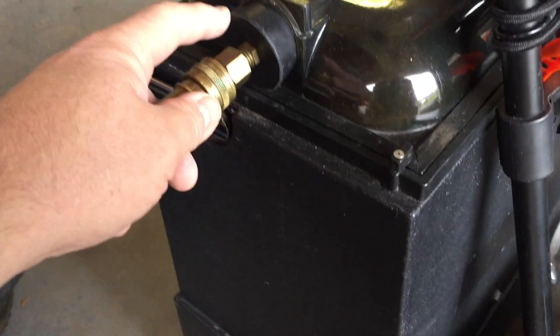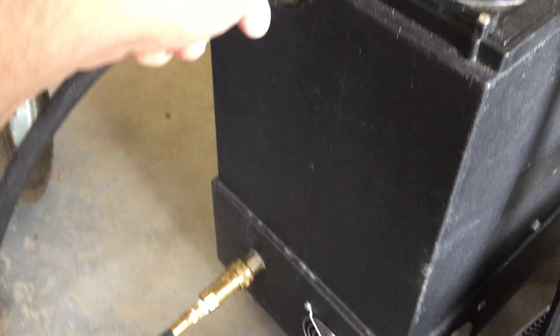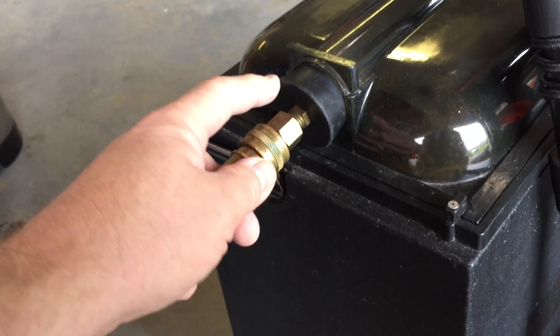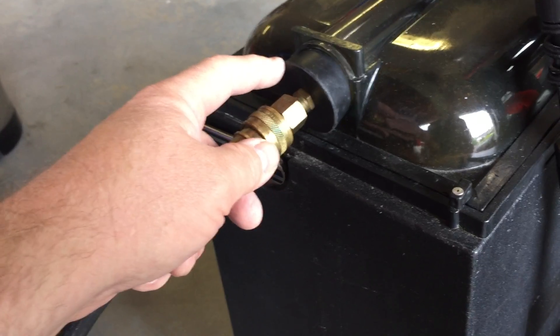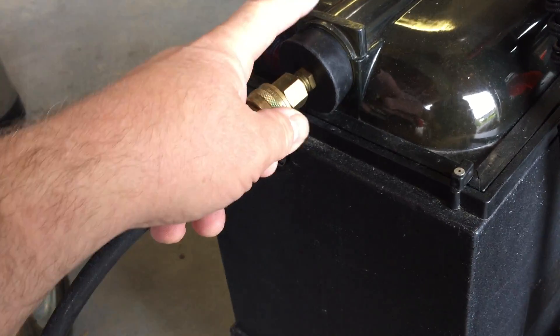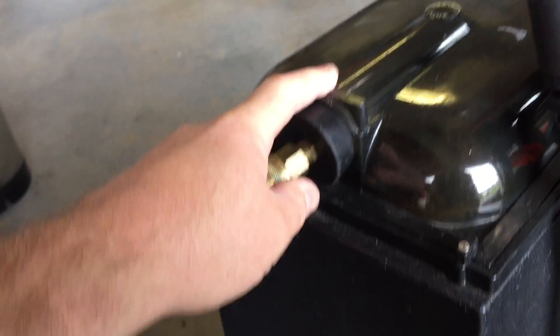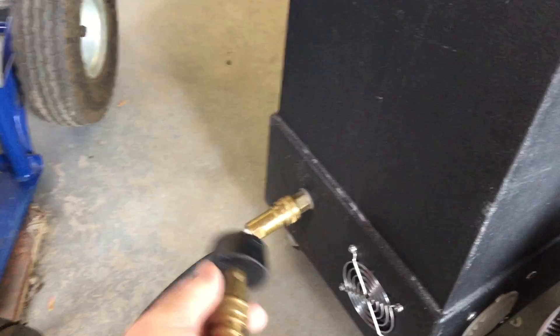In this case, for this machine it needs to be able to do that because this machine can use solvent for cleaning. So you have to remove every bit of solvent or water out of the line and out of the pump before you use it, because otherwise the solvent will gel with the water and mess it up. Anyway, this is a nice simple little primer device.